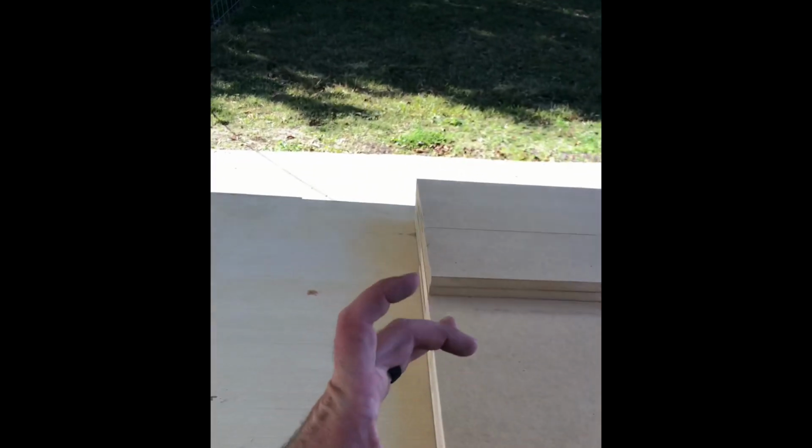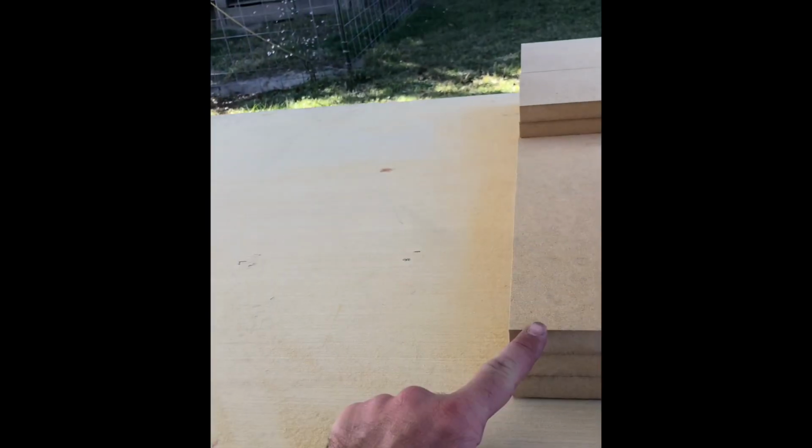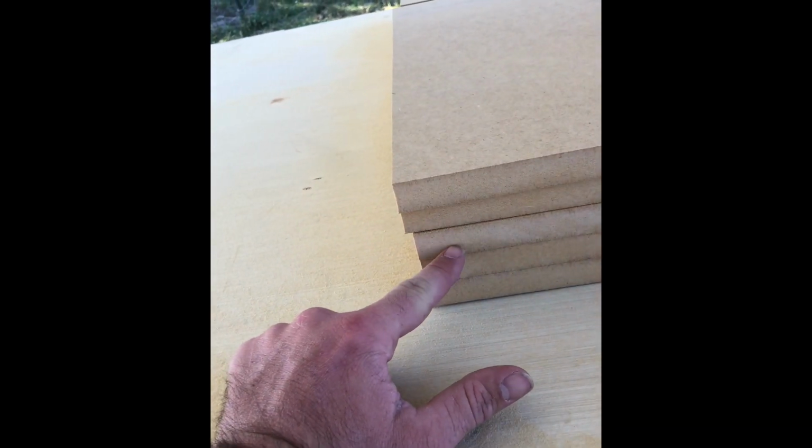We're always running hard material through it, like maple, poplar, and all that stuff like that. It really dulls the blades out, and the blades are expensive, so we don't change them too often. But a lot of the times, like with the MDF stuff right here, the blade that we're taking it out of is like a 3-inch router bit. It's a raised panel bit, and we got to take these sides down to about a 1/4 of an inch, almost 5/16.